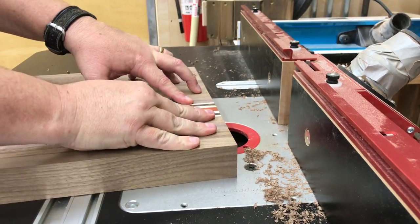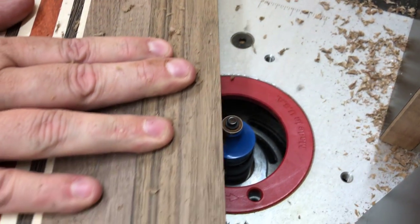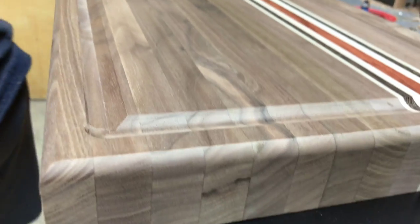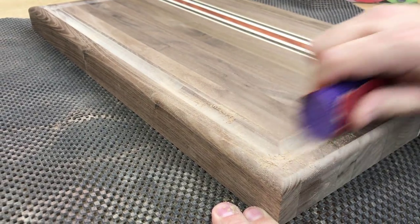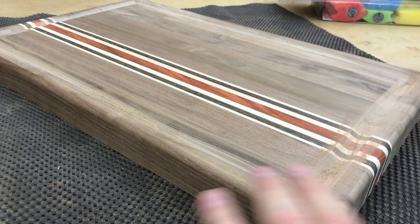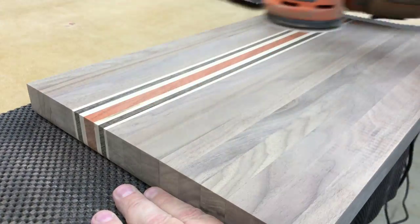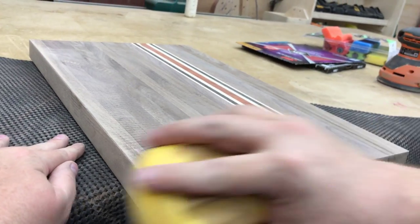We also decided to put a 3/8 inch radius round-over around the edge of the cutting board. This can also be done with a handheld router — it doesn't need to be on a router table. If the juice groove didn't come out exactly perfect with your routing, you can typically hand-sand that into shape. Then I'll sand the whole outside surface of the board all the way down to about 220 grit before applying the oil finish. The edges I'm just going to knock down by hand — I wanted to leave them square but not sharp.